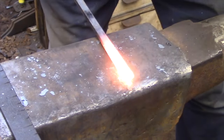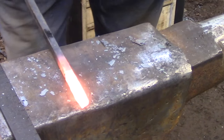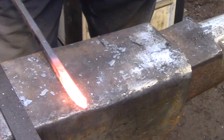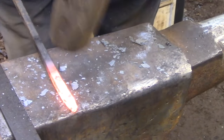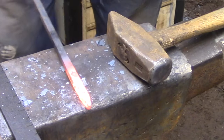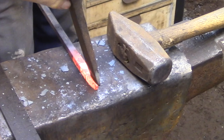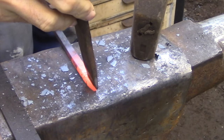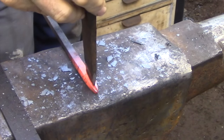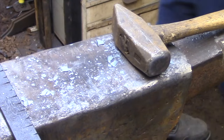Now I'm prepping the handle for the weld by forging a pretty blunt point to the bar. This is an optional part of the process — all this is doing is pre-shaping the end of the bar so you have a little bit less forging to do when you have this cleft split open and you're refining the ends. As you'll see in a moment, this can easily all have been done as one process after I split it open, so it's up to you how you want to go about it.